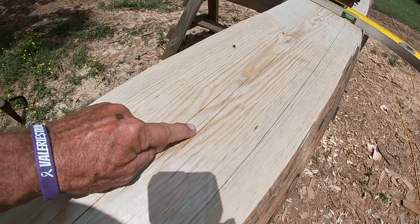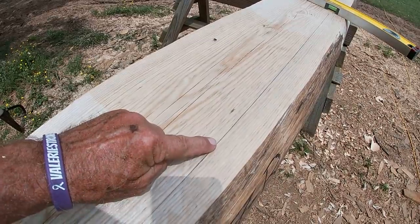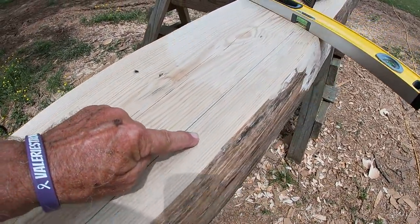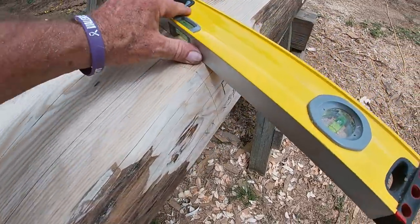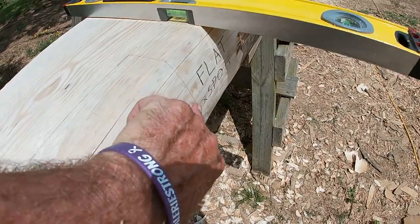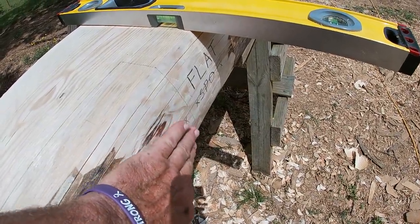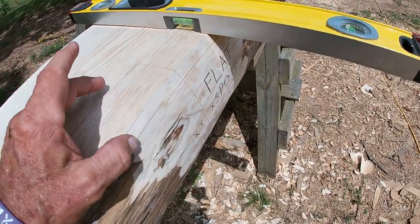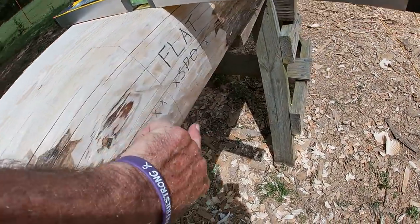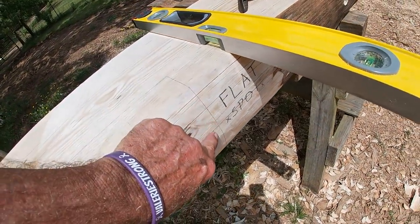And there's my center line, and I came down 2 3/4 of an inch to where I'll actually cut this out. I've got it marked across here, and I've got it scored, and I got a line transferred to the outside. I worked off the outside center line and made the same layout, and I just took my flexible ruler and connected these points here and here, and just drew it, and I took my utility knife and scored it.